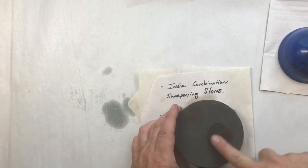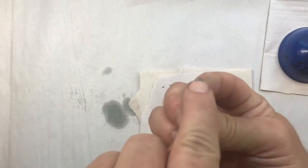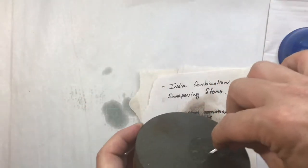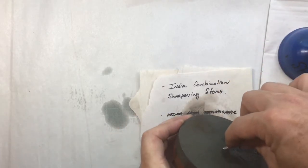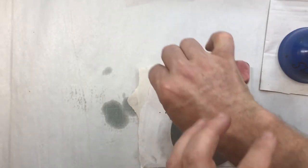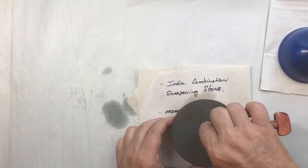If you do not have a crocker jig, you need to make sure that you sharpen the face — the facet right here. I'm going to lay this down so you can see: that facet sets flat on the stone. I don't want to rock it around — it needs to stay flat. I'm going to feel it flatten out and then go around in a circle. To do that I need to lock the joints in my wrist, hands, and elbow so I don't turn it. It needs to stay flat.